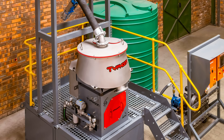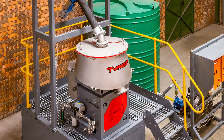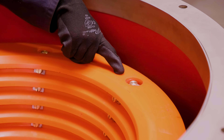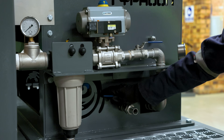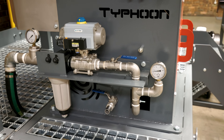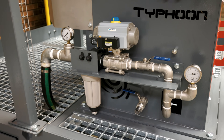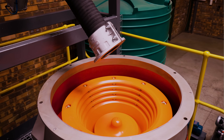The stainless steel lid has a large maintenance hatch, allowing for cleaning of the system without needing to remove the lid, launder or cone. The back-flush system is fast and performed through the maintenance hatch, meaning no more removing cones to clean out the fluidisation holes. The Typhoon is fluidised but has no water jacket, so there is nowhere for silt to build up — a perennial problem with old-style centrifugal concentrators.